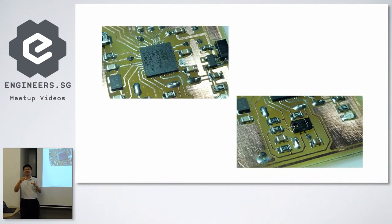So a little bit more about what you see. We saw the video when we were using hot air. We used some solder paste to solder this one. The one problem is that it jumps, although the surface tension pulled the part into the center, it jumped one position away. So we spent like half an hour just to solder this chip, but it was done within one board, I would say. And after hot air treatment, I just use some solder and touch up the edges.